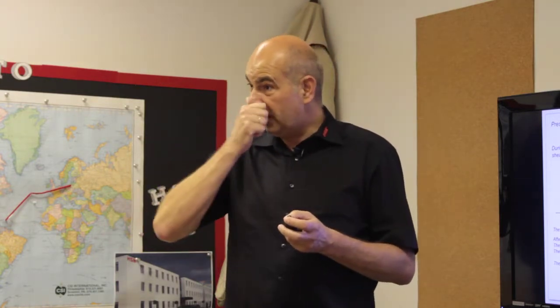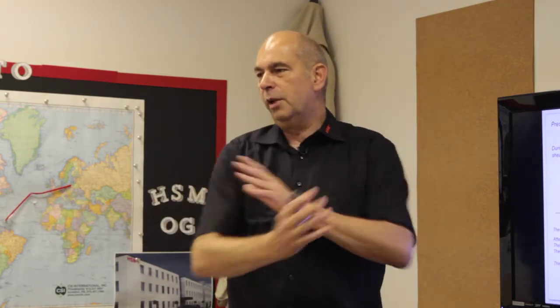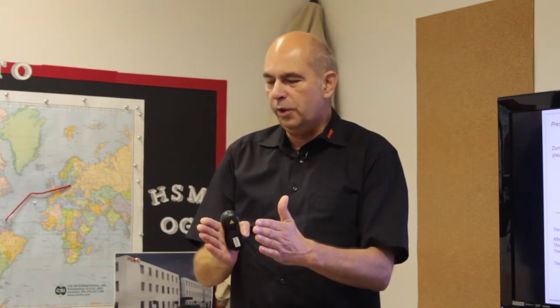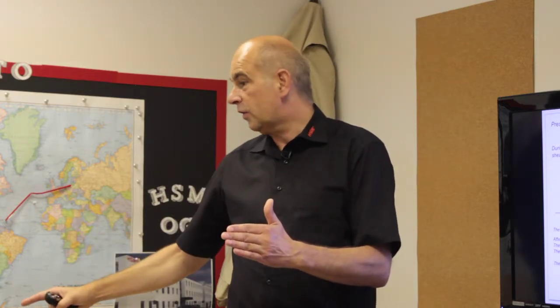So you have to adjust the speed, for example, because when you have 190 bar and the channel opens completely and very quickly, then the material goes forward directly. You should make sure that you open very slowly, so the pressure decreases to only 180 bar, and then you close again. So you only open a little bit, close, open a little bit, so that the material can only move very slowly.